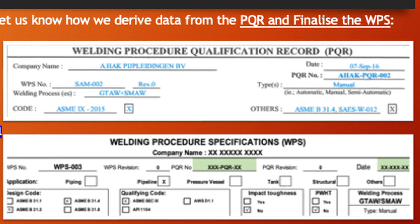Whenever we make a WPS, we have to think for the future also. For any procedure qualification test, we will try to create the maximum range so that for any future project we can also submit this WPS to get it approved. Not only for seawater — we will also tick for the piping code ASME B31.3. Impact toughness is not required for seawater service. Post weld heat treatment is also not required. The welding procedure is GTAW for the root with argon, and SMAW for filling and capping.